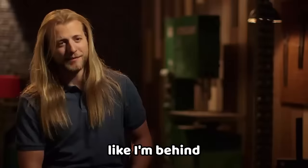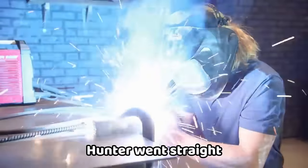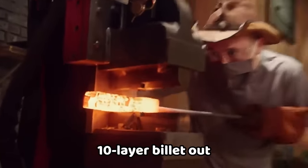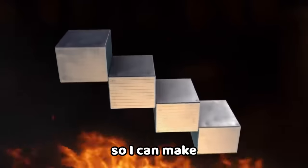We've only just started and I already feel like I'm behind everyone else. Hunter went straight for the welder — you think that's a good idea? It's a risk. So I stretch my 10-layer billet out about eight inches, and that's when I'm ready to cut and stack my billet so I can make those 40 layers.